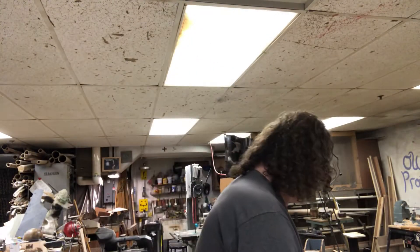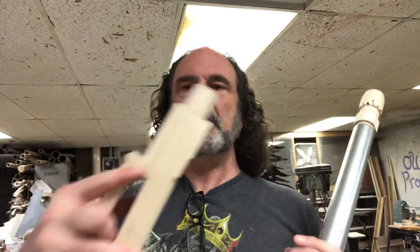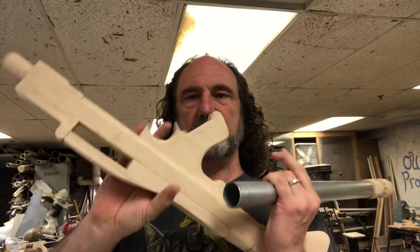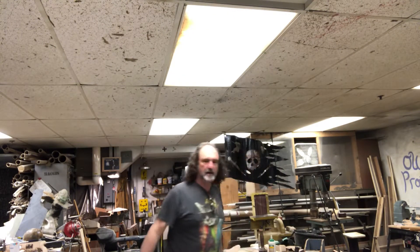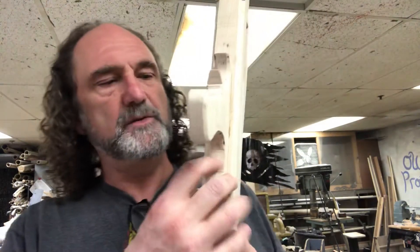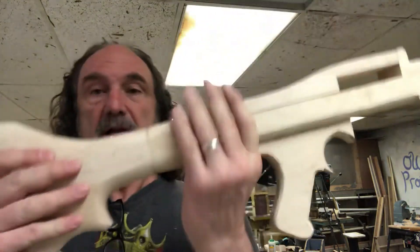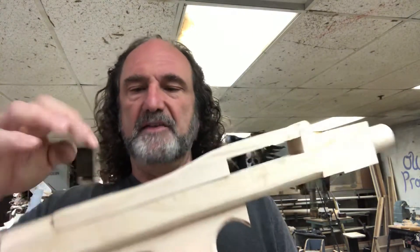I've got a barrel on one of them. The way I did it was using the lathe — I made myself a little turned piece and put everything together using dowels, basically with a self-centering doweling jig. There are dowels that run through it, making a very solid attachment. It's not just glued on, and I didn't do any screws either, though that would also hold pretty well. This piece has two dowels going one way and two dowels going up into it the other way.